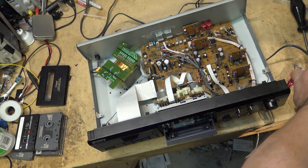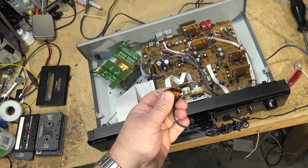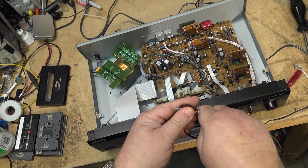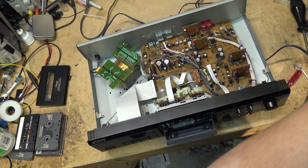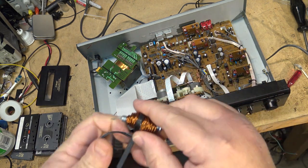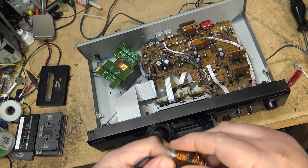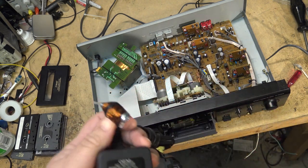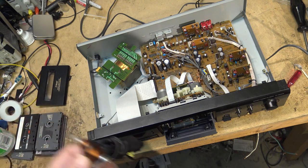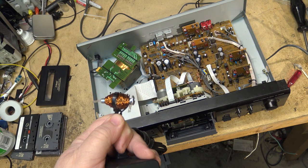And that's about the duty cycle of this thing, because this thing is starting to get warm. Not hot yet, but it's starting to heat up. And that's just because I don't have enough wire wrapped around here for the voltage that I'm putting in. A 12 volt transformer for this length of wire would have done just fine. After all, this was the winding out of a 12 volt motor, out of a drill.